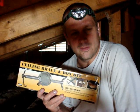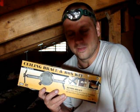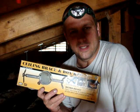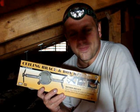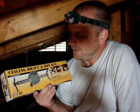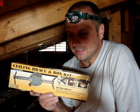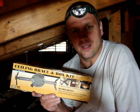The alternative is the fan falls on you, or the fan falls and the Romex wiring catches it, and then the blades hit the ceiling and shatter and go all over the place. I've seen it happen — you wake up in the middle of the night covered in bits of fan blade and your ceiling's all messed up. So getting the appropriate box in is a pretty big deal, because ceiling fans are heavy and you don't want one clocking you in the head.